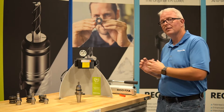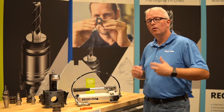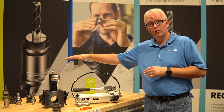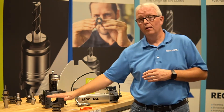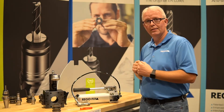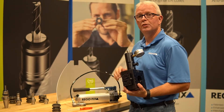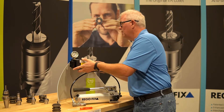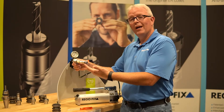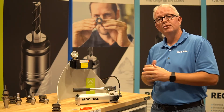We've covered a lot of stuff on the PGC unit, but we haven't shown you how it goes together — let's do that next. When you receive your PGC unit, you receive the PGC head unit, which is the hydraulic press portion, the backstand to hold the head, the hand pump insert of your choice, and a screwdriver to allow you to change those inserts easily. Simply grab the PGC head, which has grooves on it. These grooves will line up with the channel in the back of the backstop and slide it together. All the weight is supported by the backstop, so you don't have to worry about anything additional there. The hand pump itself has a quick snap hydraulic fitting that goes right onto the back of the head. It's just that simple, and we've already shown you how to put the insert in.